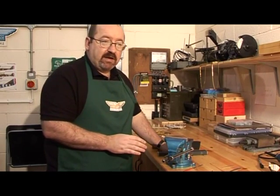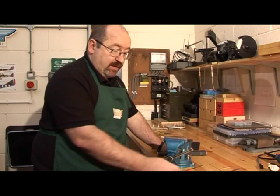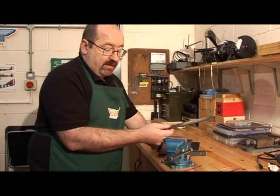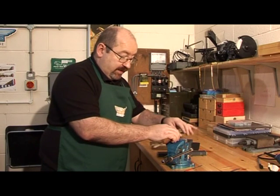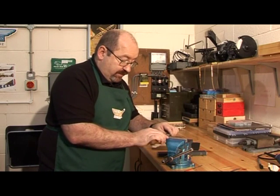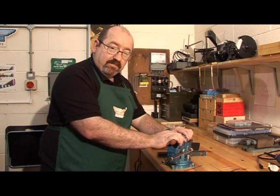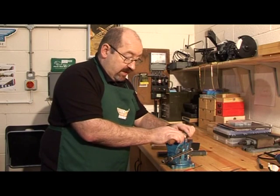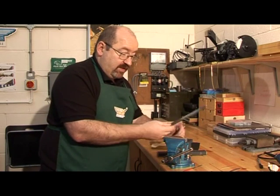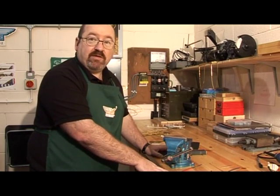For those who have extra tools in their garage or workshop: if you've got a larger file — as long as it has a fine cut on it — you can make the needle file process a lot faster, particularly on the larger components such as the main stem and the wings. If you don't have one, it doesn't matter — the needle file and the wet and dry works perfectly well.